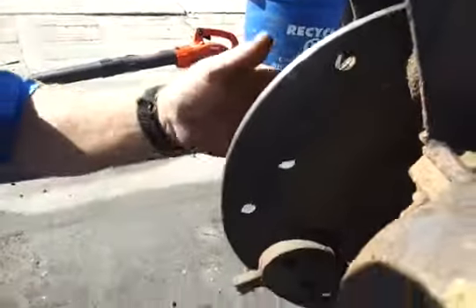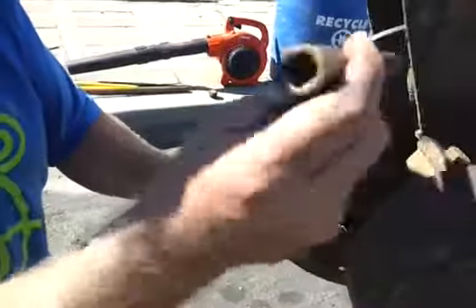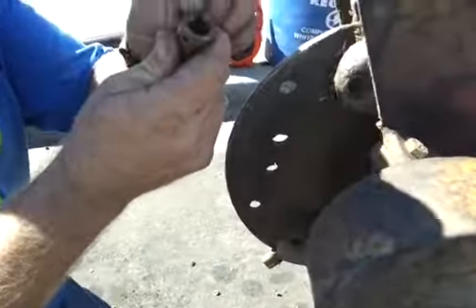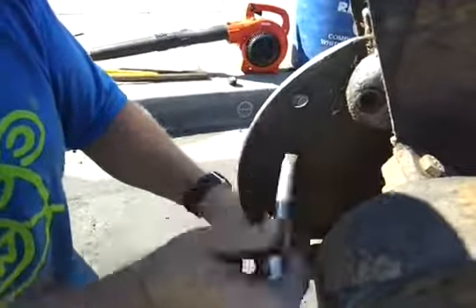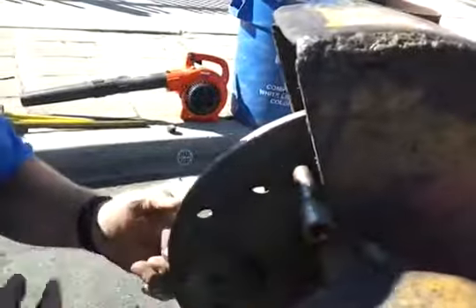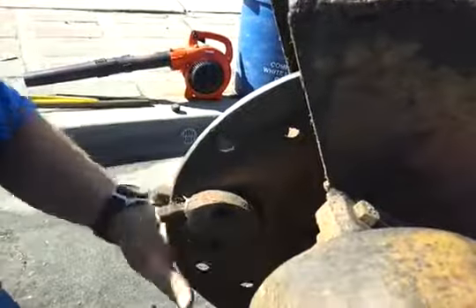On most of these wheels, we've got little holes. I take an extension — something I'm going to get rid of, it gets hammered and wasted — and I stick it in these holes. It fits perfectly. It plugs it up so that it doesn't spin. I put it far enough back so that when I get it, my wheel's sitting in front, just like that.